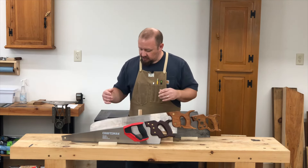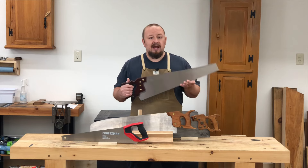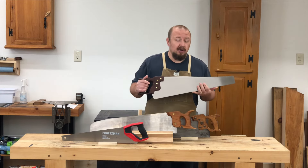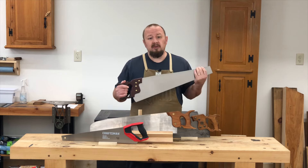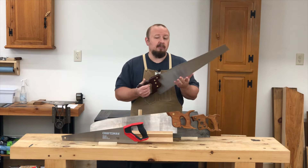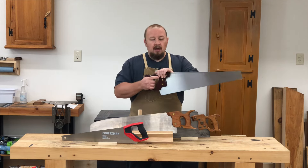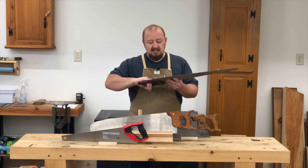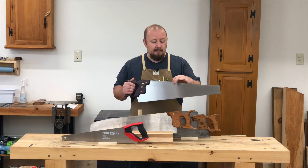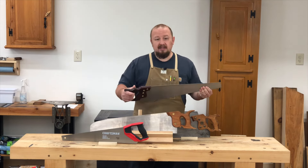As I mentioned about the sharpening, they may or may not be well sharpened. There are certain manufacturers that actually do a decent job of sharpening their saws and selling them for under $100 to just over $100, and they are sharp and usable when you get them. Others, not so much — this saw was $85 and it's not sharp. I would not use this without sharpening; it's just not going to work well. But other than needing to be sharpened, it seems to be a decent saw — it's tapered ground, and I did put a measurement on it and it actually is tapered ground: thinner at the back than at the tooth line, which is a good thing. So for the price, it's not a bad saw, but it does need sharpening.